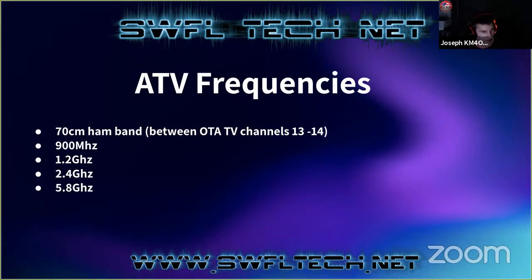which is 5.8 gigahertz. The most common frequency used for amateur television, with the availability of equipment now, is 5.8 gigahertz. With that being up in that high band, you get a lot of channels too. So there's like 40 or so channels available to be used on the 5.8 gigahertz band. And that's mostly the same for 2.4 gigahertz.